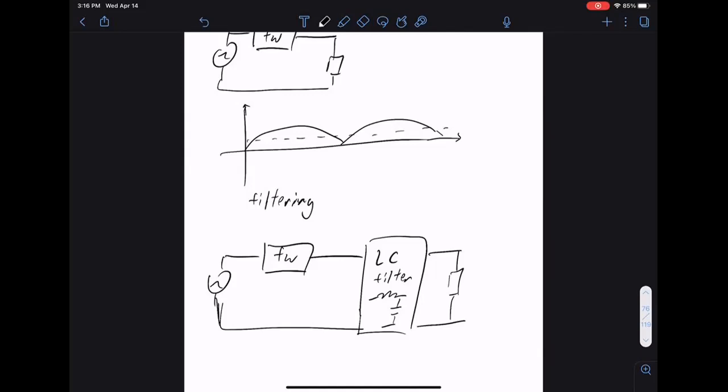Of course, in practice, we cannot just add in large capacitors. We don't have enough space to do that. We need to be clever in the filtering design. A lot of power electronics design is how do you deal with the passive elements? How do you make them small, make them efficient, make sure you don't lose power by switching too quickly through a capacitor? All those kinds of issues come in, which we are not going to talk about, but are definitely something to keep in mind, to know why power electronics design is not trivial.